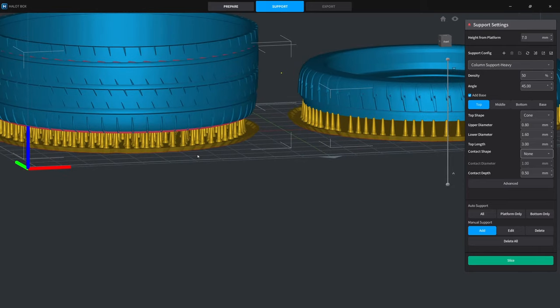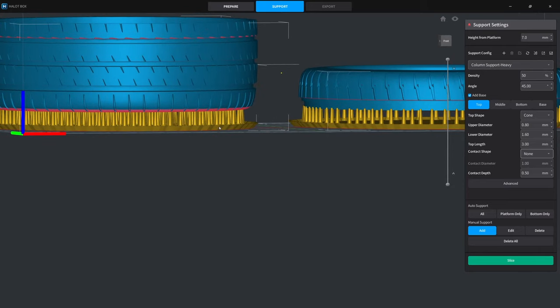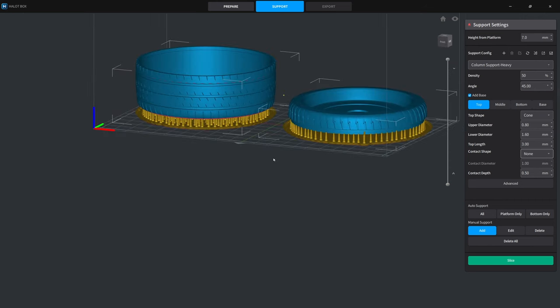But for the first, like, this thickness here, when you're printing, typically your resin's cold and it's got to warm up, so, like, it changes and it deforms for that amount of section anyway. So to print directly flat on the surface, you never get good results. So if you can, you should always use support so that by the time it's got to this section here, all your resin's got to optimal temperature and it's like all consistent. That's what I find with supports and why I use them.